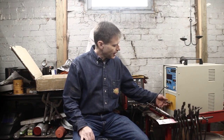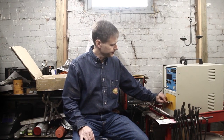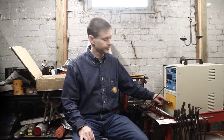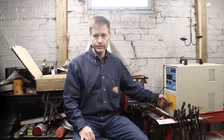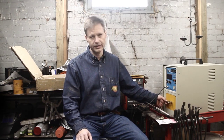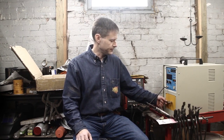So let's talk about basic coils — how to make them and what your options are in terms of tubing, fittings, and so forth. Looking at your machine, I have these extra wear nuts on. They're basically the same 8mm flare, like an M14 1.5mm thread spacing. These extras take the wear. You can get those at Metalworks. I'm going to refer to Metalworks several times in this video for your supplies.